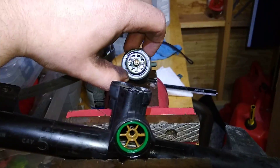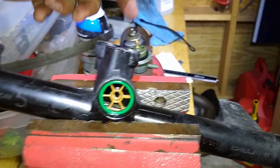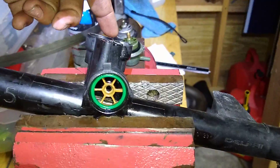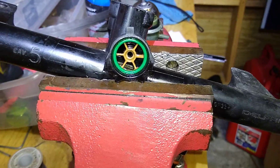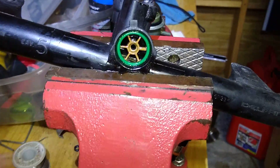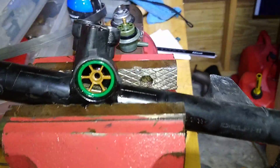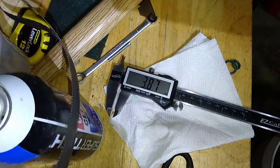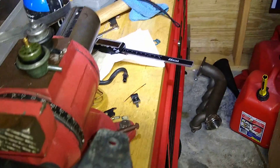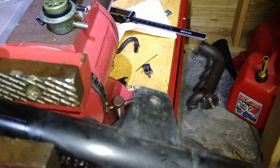I think the major difference was obviously the porting itself. Experimentally, if I had to do it all again, I wouldn't touch the cavity — I would try doing the porting completely first and then see if it drops down the fuel pressure. If it works, great; if not, then I'd go and port the cavity too. But this being all the way up to 3.87 on the mic, I'd say that's probably enough to drop down your fuel pressure.